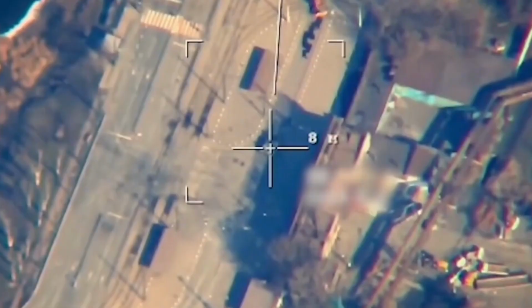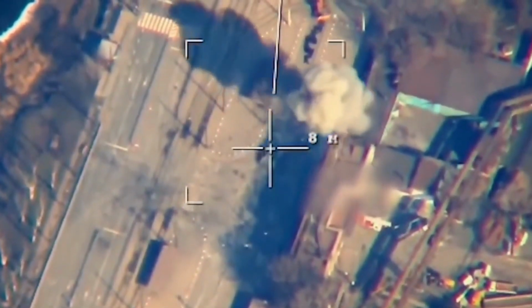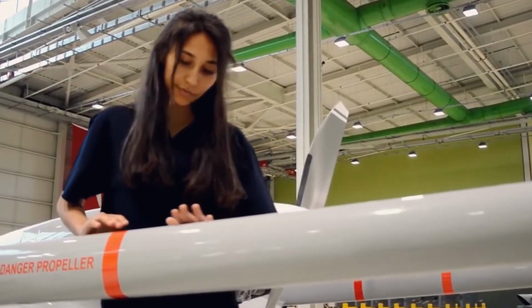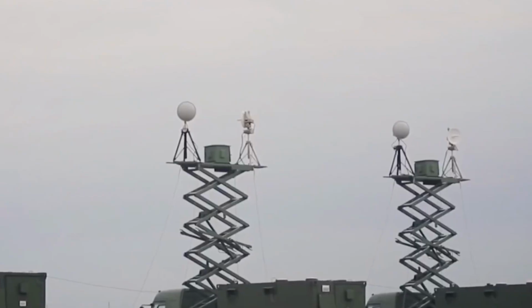Digital flight control systems. The TB2 has a triple redundant flight control system with autonomous taxi, takeoff, cruise, landing, and parking capabilities. If we talk about the computerized flight control system, it is the primary component that conducts the sensor fusion algorithms with the real-time sensor data. Mission-specific controls are handled through the mission control computer system, whereas the electronic power supply of the onboard systems is supported with triple alternators and balanced smart lithium-ion battery units.